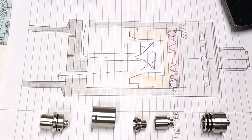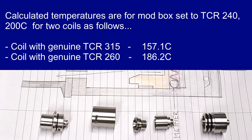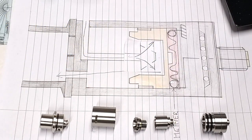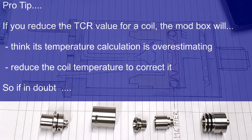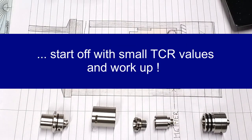Several redditors seem to be recommending a TCR of 240, and that really does sound like a sensible option. But because of the wide range of specified TCR values, actual temperatures of anywhere between 157.1 and 186.2 degrees centigrade would be present for a desired temperature setting of 200 degrees centigrade. I can show the maths for these figures in the description if you're interested, but the point is that because of the puzzlingly wide range of possible TCRs, some experimentation is going to be inevitable. Starting off with low settings — say 170 degrees centigrade and a TCR value of 220 — and working up from there is well advisable.